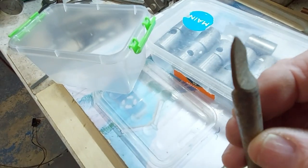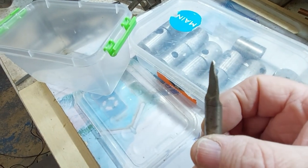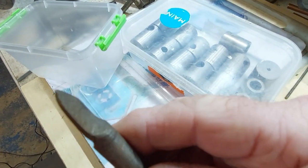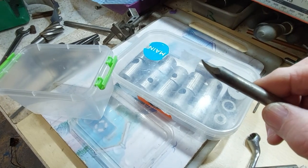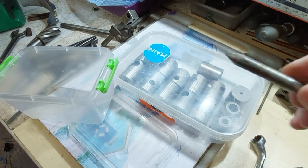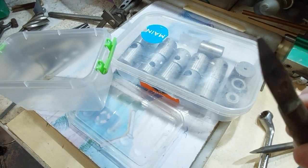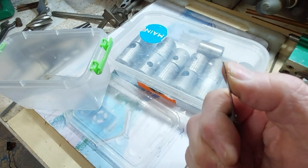Here's a view of some of my other tooth rests — these are 3/8 inch diameter ones as opposed to the 5/16s which I'm currently using. Different shapes, different thicknesses, and slightly different points for different kinds of cutter. They're all hardened at the tip. This is the flexible blade type, made from old hacksaw blades.